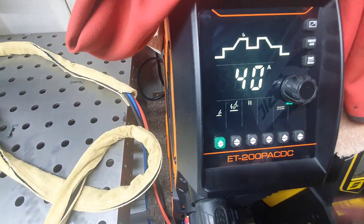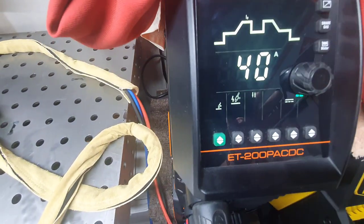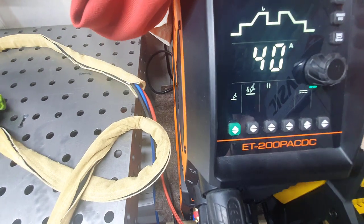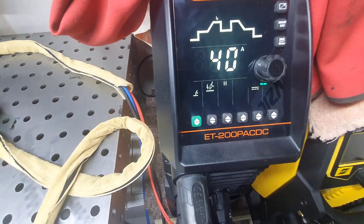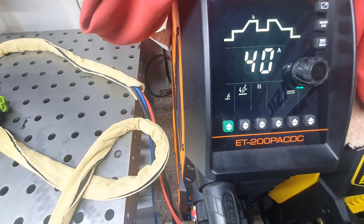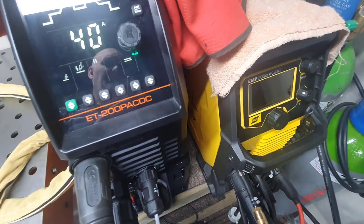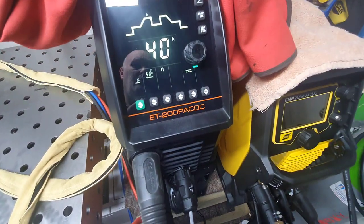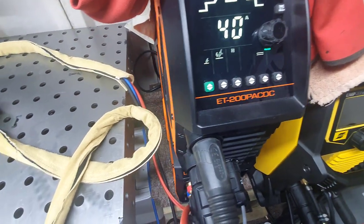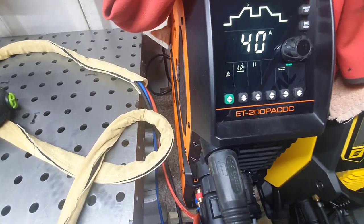If it's under 150 amps your post will be a lot more than four seconds - the machine does it for you, which is quite good. The water cooler button I'll hit in a minute because that's one of the bug bears with this machine. That's pretty much it with the controls, so it's quite simple. On the AC/DC balance on this one, it's opposite to the ESAB - the balance you've got to set to around 40, whereas on the ESAB you've got to set it to 70, so some machines it's opposite.